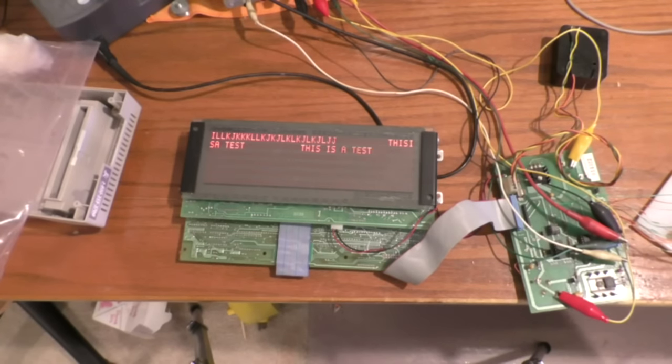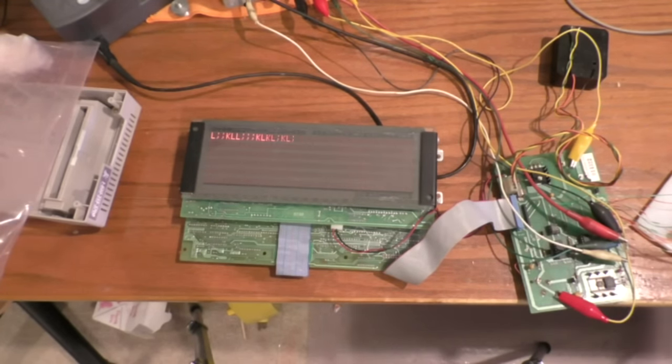That works. I've figured out some of the other control codes: Alt-12 clears the screen, Alt-8 is backspace, Alt-9 is forward space, Alt-10 moves down, Alt-11 moves up. Alt-1 through Alt-6 don't seem to do much. Alt-8 does backspace and Alt-12 clears. I wondered if Alt-13 is home - and yes, 13 is indeed home.